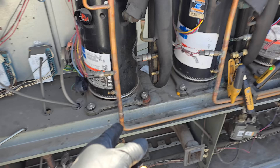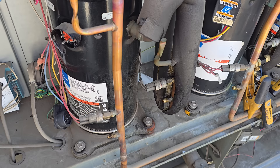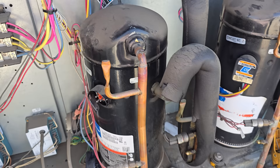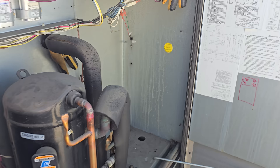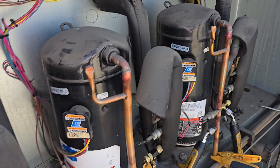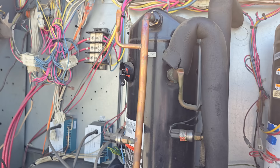It's a rudimentary test — we could do an acid test, but to do a proper acid test you really need oil, because the oil is where the acid test will happen. But I smell burnt refrigerant, therefore we are diagnosing this as a compressor that's bad with burnt oil. We're changing the compressor, changing the refrigerant, and doing a proper cleanup procedure using HH Core Sporlan dryers — which are high-wax-removal dryers due to acid. We'll make that part of our quote.